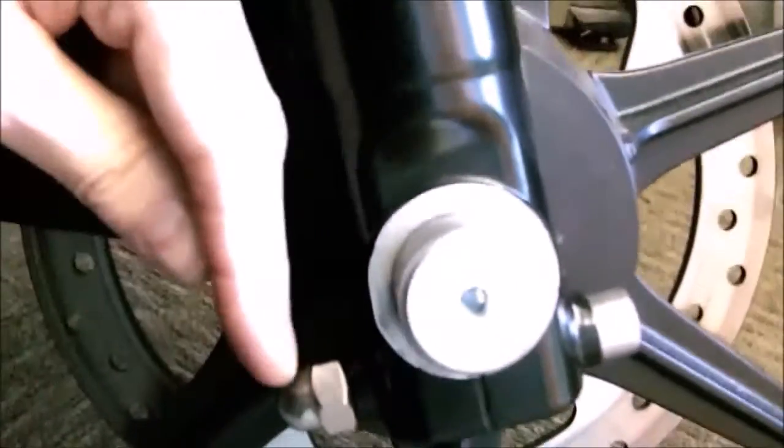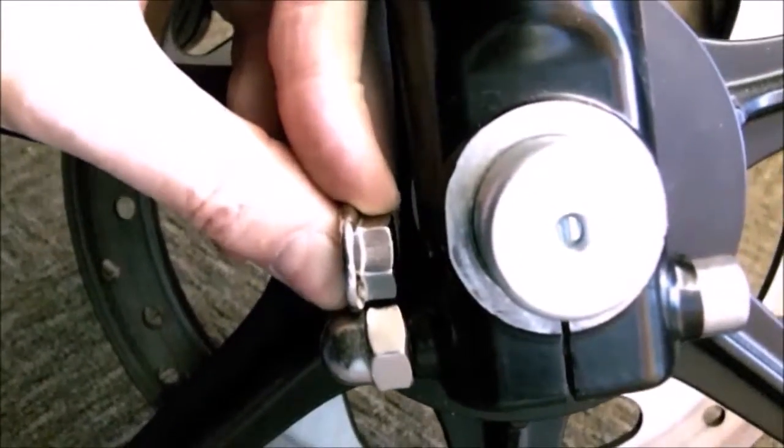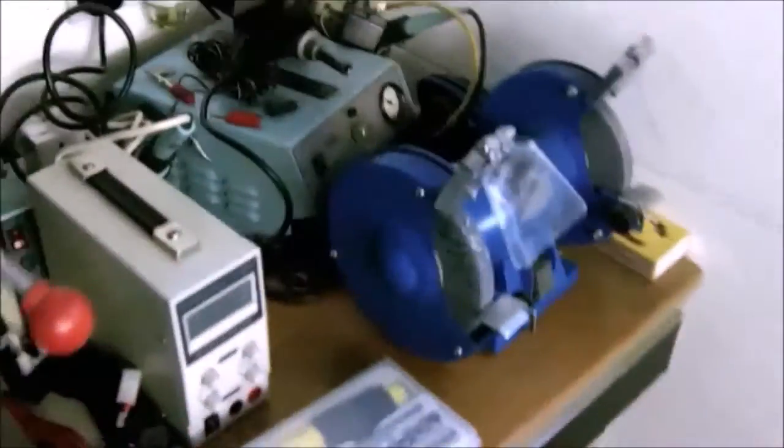Push that on there, make sure I'm zoomed out. Spin the dome nut on — the dome nut fits nicely because it's a much shallower nut. The flange uses up a lot, and we didn't want it munching into the alloy on the hook. So we got the pillar drill out and the grinding wheel out. Stuck the bolt on a bit of 10mm studding that we had for pulling wheel bearings — safety goggles, safety goggles.